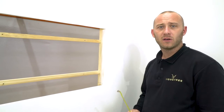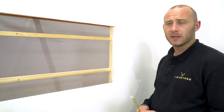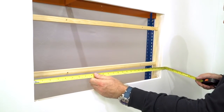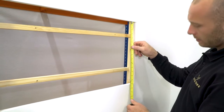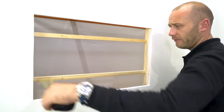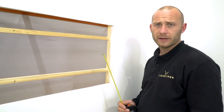First thing to ensure: at your desired position of your TV within your bathroom or wherever you're going to situate your screen, take measurements and cut your wall at 636 by 386 by 43 millimeters. This will ensure that your back box goes into the wall correctly.